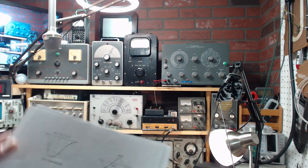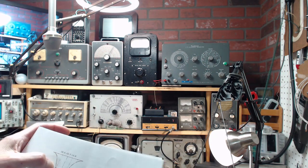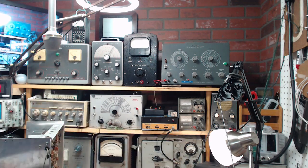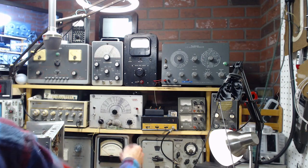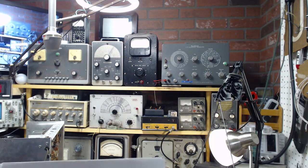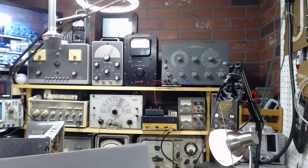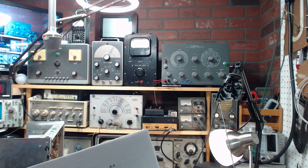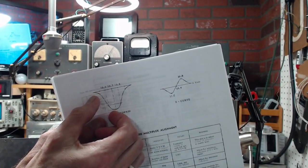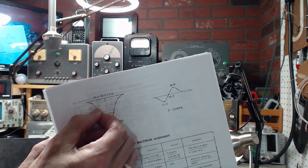That extra circuit enables this guy to create these kinds of very, very sharp, refined marks. Now, you saw me attempt to use a marker amp to generate a mark at this point. All I was doing was using this guy running at 10.7 or so and allowing his signal to come on top of the signal of the other generator. And the result of that is a very hard to see squiggle in the line, which is stretched out, and you have to use your judgment as to where the middle is.